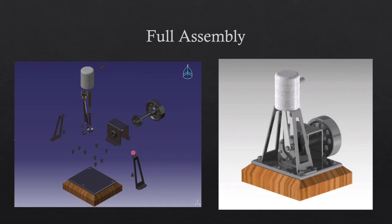Some of the most difficult parts were the support bearings for the top casing. The dimension drawings provided were not particularly helpful — they featured an unfolded sheet metal design, which was uncommon in their experience. They were looking at auxiliary views that weren't matching up and were confused about the dimensional inconsistencies. Ultimately, it was straightforward to intuitively look at it and use symmetry to find the proper dimensions, and when fully assembled, everything fit perfectly on the first try.